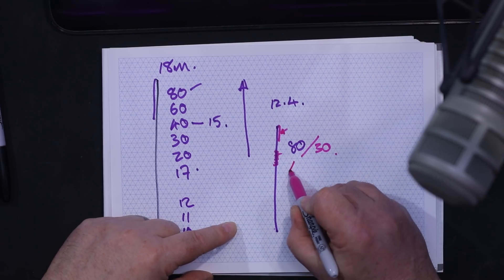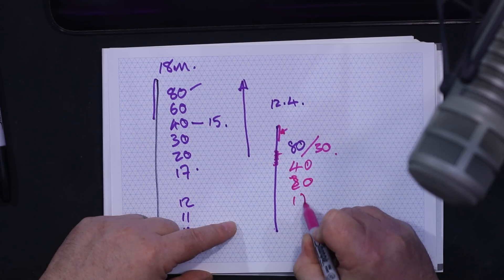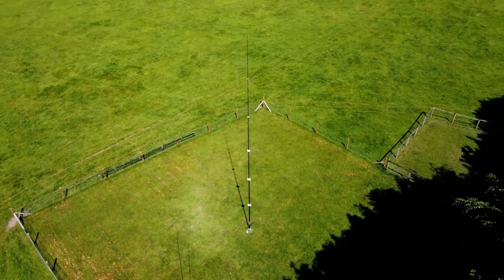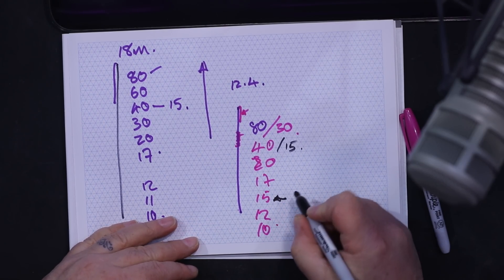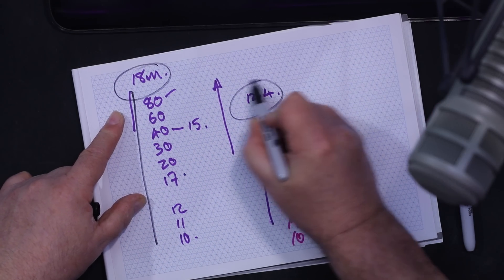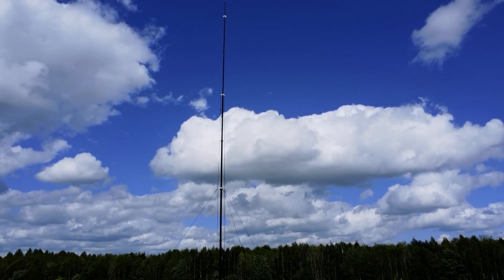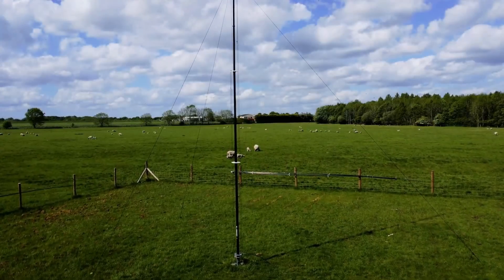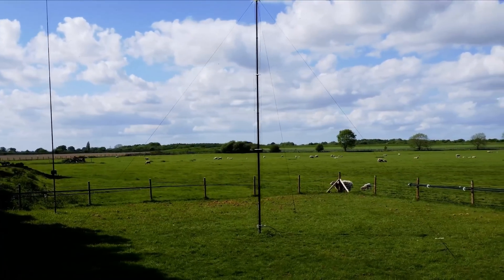With that coil we get a perfect tune on 80 and 30, and you get about 120 kilohertz under 1.5:1. Then like the rest of the classics you get 40 — you don't get 30 because you've already got it — 20, 17, 15, 12, and 10. I may one day look at making that a 40/15 arrangement, which could free up a slot for a three-quarter wave on 6. Be aware: as of April 2023 we are extremely low on stock of the 12.4 — China won't ship for another two months and it'll take two months to arrive.